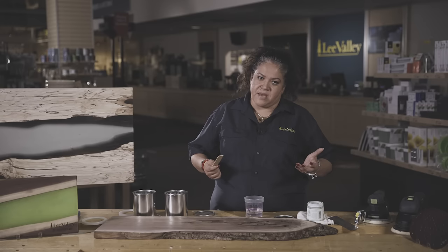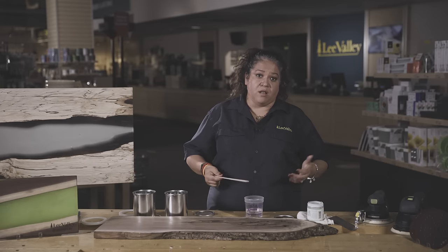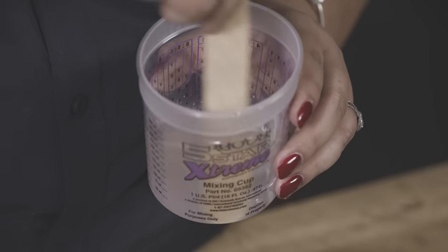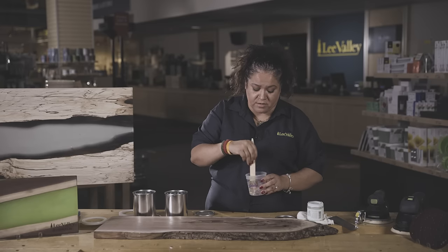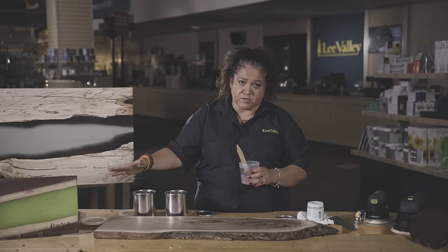Depending on the volume, you need to mix and mix thoroughly. For larger volumes you might want to use a drill with a mixing attachment. The key is to be consistent so it mixes thoroughly and you get rid of as many bubbles as possible — that's why mixing is really important. We'll mix for about five minutes here; for a larger batch, about 10 minutes, and for a gallon or two, use a drill with a mixing attachment for a full 20 minutes. This is a clear pour, but you can add colors, and there's a wonderful variety as you can see from the projects here.